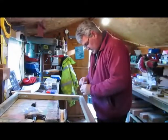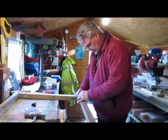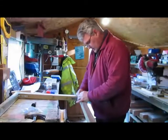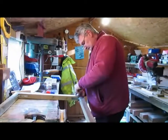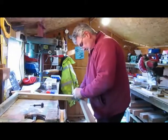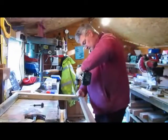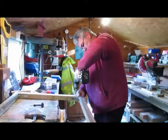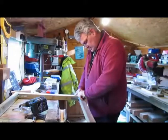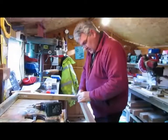And these, we'll simply use those lines as a guide for where our screw centres go. It's as simple as that. And once again, we'll mark just the one. Okay. And we'll get a screw into that to get that secured. Lovely. I think that might want to come round just to ease that screw back a little bit. Come round so that's central.